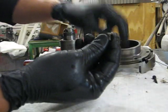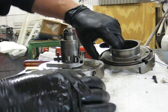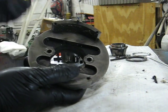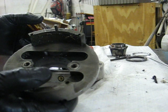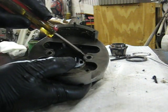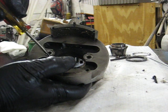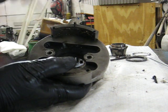And here are the two slotted screws that were removed from the sliding sleeve. In the rear part of the housing, there are two bearings that support the rear of the posts. This is a very fragile component of the tool head, so you must be extremely cautious when reassembling to not force the head together and risk breaking this casting.